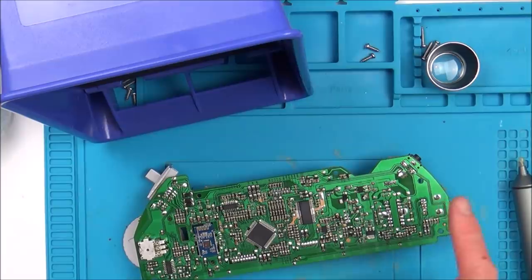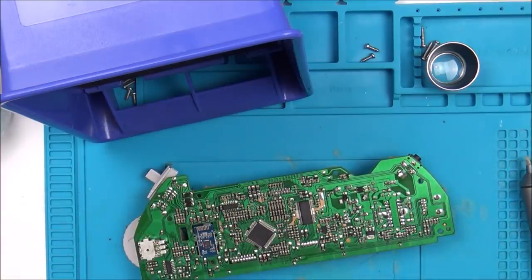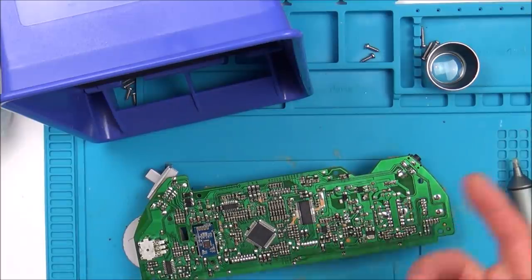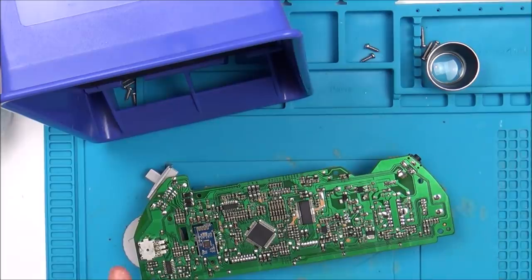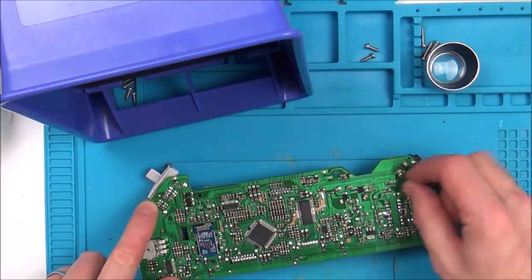So I'm going to do that. Another thing I could do before unsoldering it, but I haven't got it set up, is when I did a Walkman video ages ago, I had a few messages, one in particular from Standish Geezer, who basically told me how to make a probe. So I've already got this speaker amplifier thing, and I can put a 3.5 millimeter jack into that, and then out of that I have two wires. Use two of the wires, ground one of them, so I could just use a ground, and then I can probe the other one on different points.